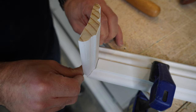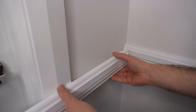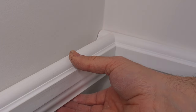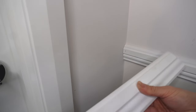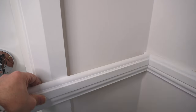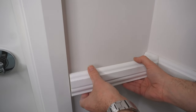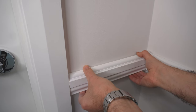That should work out. Let's have a look at it on the wall. I've got my scribe cut here, time to do a test run, see how it's going to go in there — and that's going to be pretty good, not too bad. Next thing I'm going to do is just mark it off at that architrave where it ends, and then I'm just going to do a 90 degree cut and I'm done. That's cut to length hopefully — let's give it a little bit of a test fit. That's going to be nice and tight. I won't push it all the way until we have the glue on it, and we'll nail it in place.